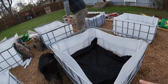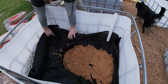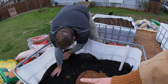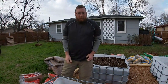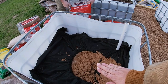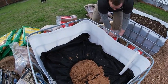So it will never hold excess water past a certain point. What we're doing now is filling them with sand. We have 16 feet of drainage pipe, three bags of rock, and then we'll put five bags of sand in there. We fill up the middle part where we didn't put rock with sand, then we'll make a smooth sand surface all the way around the outside, level that, and that will be our water reservoir.